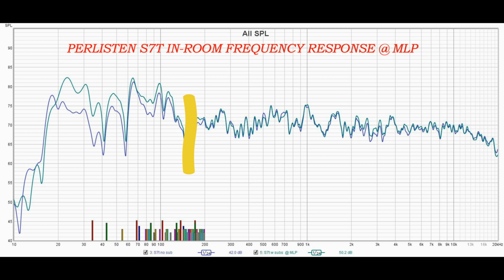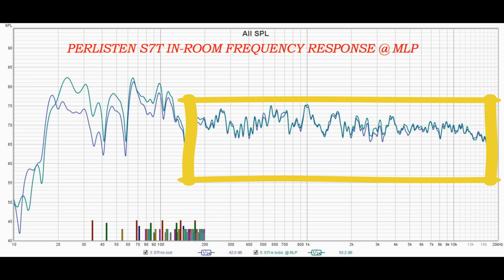And when you have a speaker that's this accurate and this neutral, you don't need full bandwidth room correction. You see in this measurement how linear this is. Full bandwidth room correction has the very high potential of just messing that response up, and that's not something I want to do. I'm just really happy with the sound as it is now.